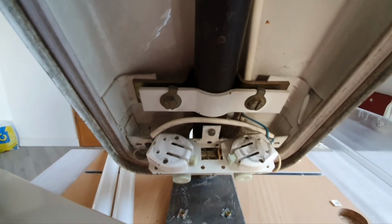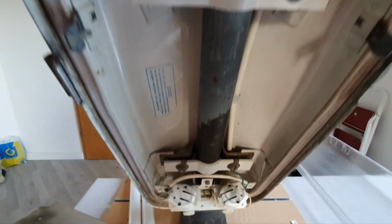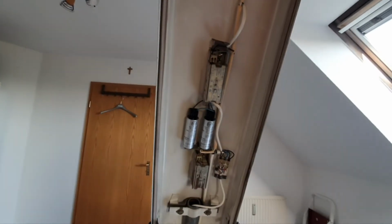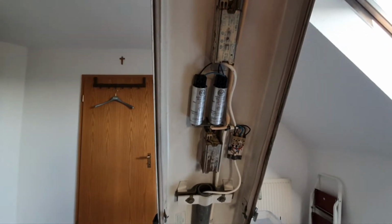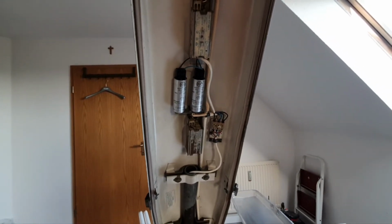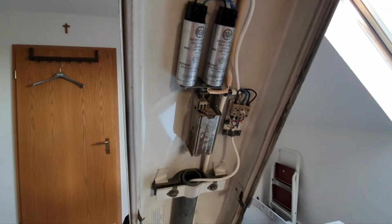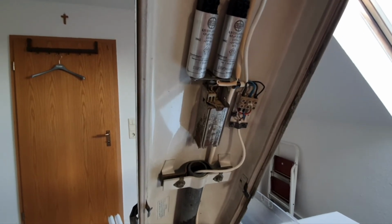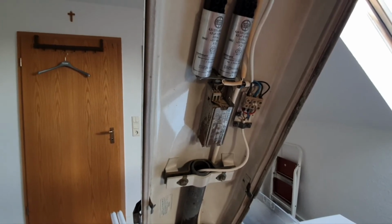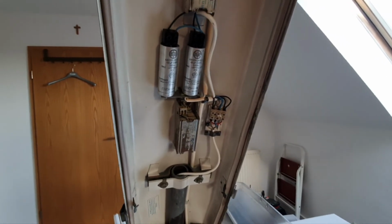And there you have the rest of the electrical, the starters and the 2 lamp holders. So it's a very simple design, I must say, and this fixture is extremely popular in West Germany. Even today in LED time it is very popular, and the pressure on changing them out to LEDs is not that great because this fixture just doesn't consume that much energy. If you just put one tube, it's 40 watts plus maybe 5 to 10 watts loss on the ballast, so it's not that bad. I mean, most of the LED fixtures consume maybe 30-40 watts, so that's not that much of a difference, and they don't change it.